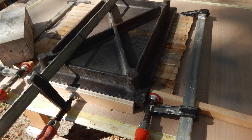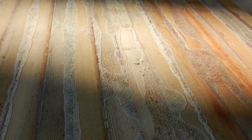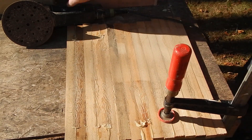Not very pretty, but after a couple hours this moisture-cured glue kind of foams up. It's nice, fills gaps, pretty messy here. And the strips aren't perfectly aligned, so I'm going to come at it with some 60 grit on a sander, and just level off all those strips.